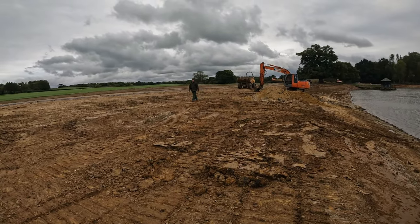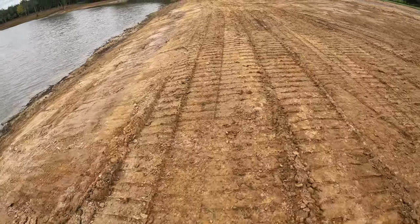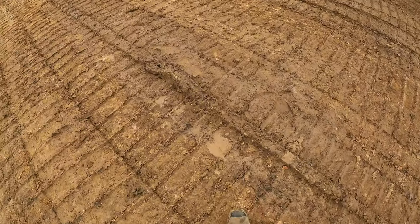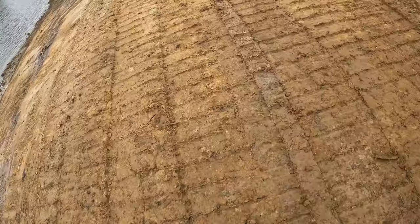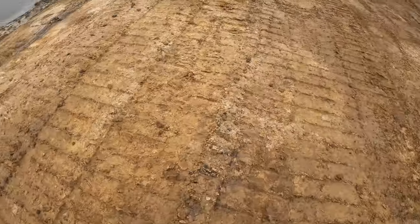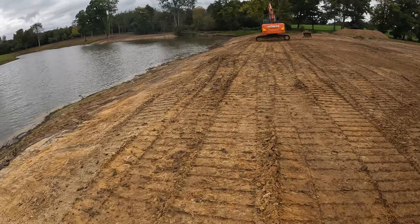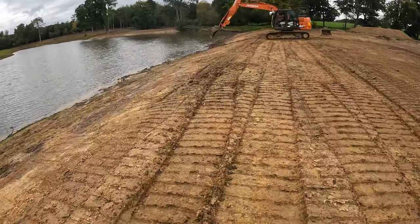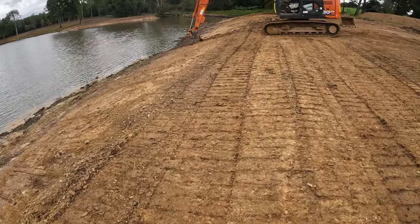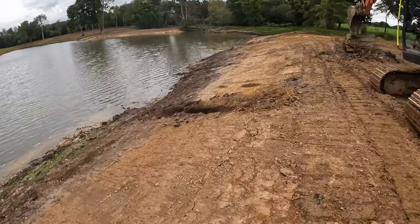There is our hero, Dave. And that bank is made out of sand, pretty much. Well, God knows what happened, but we got these random spots, and then water just coming up to the surface, and then we got some really, I don't know if you can see, but it's like carpeting, really spongy. So we're digging some test trenches to find out where the water is coming from. We did one already, and by the looks of it, it's the bottom layer of material, which is most likely sandstone and water, probably just a water table going through between the layers of the sandstone. We'll find out.